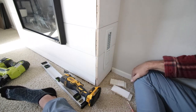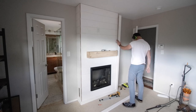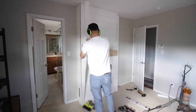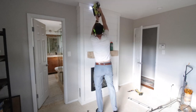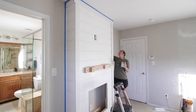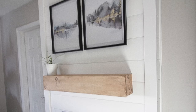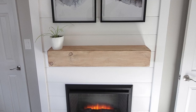Next I installed the baseboard around the bottom of the fireplace, then the vertical trim pieces on each side — leaving a little bit hanging on the outside so I could do a quarter round on the inside. I then attached the top trim with a little craftsman-style overhang. My wife rocked it with the painting. I also added quarter rounds on the insides and took off the mantle so we could paint all around it. You can see the outlet I installed for a future TV. After painting was done I put everything back — and there it is: our brand new bedroom shiplap fireplace with an electric insert, a floating mantle, and the ability to mount a TV. This project has been awesome, I hope it was helpful, thanks for watching!